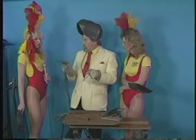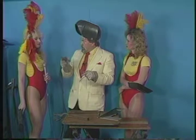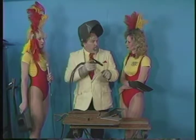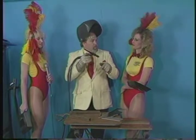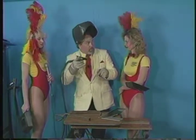Now when we do aluminum welding, we run it on high frequency all the time because it's alternating current, and you've got that violent process of the electrons going back and forth and breaking up, and you want to keep the arc established, okay?